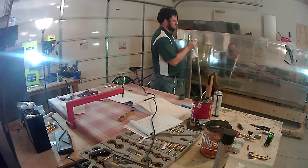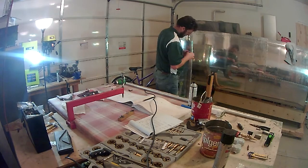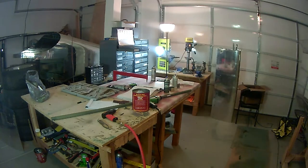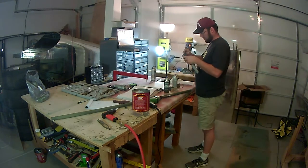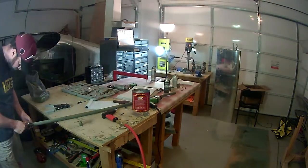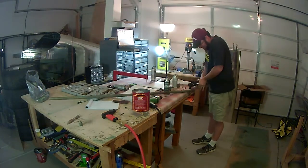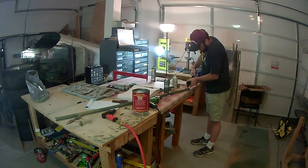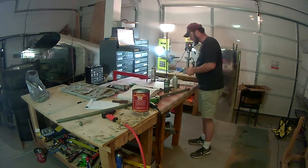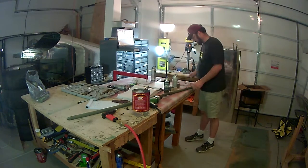As I said in the introductory part of this video, I'm attaching and creating all of the aileron actuation pieces. You have the torque tube I'm working on, which will go from the actuator at the root of the wing to a bell crank about three quarters of the way down the wing, which then attaches to a rod that connects to the aileron. This is just the process of putting all these pieces together — one of the mechanisms you assemble that will never really be seen.